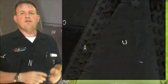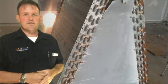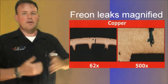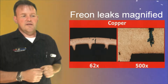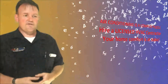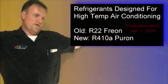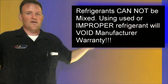One thing you have to realize is that when the Freon leaks out of the coil it's not necessarily visible. You might take the panel off and say you don't see any Freon leaking out anywhere. Typically the atmospheric changes will convert that gas from a liquid into a vapor. A lot of times the leak is so small — pinhole leaks — that it evaporates before it can fully be relieved from the unit. Sometimes a system blows its charge instantaneously and you get a puff of vapor, but it's gone — because once that refrigerant hits our atmosphere, it evaporates.